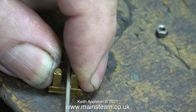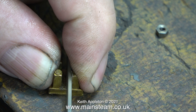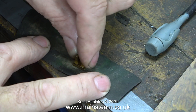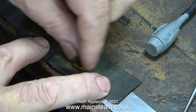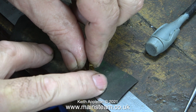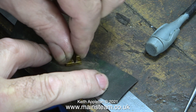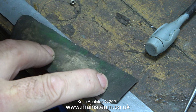I've had a good look around the engine, and the flywheel, the engine base and other things need a little bit of attention before I paint them. In this clip I'm using some 400-grit wet-to-dry sandpaper to re-profile the face of the valve. And here's a good tip: for small jobs like this, rest your piece of sandpaper on a ruler — that's pretty flat.